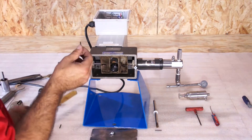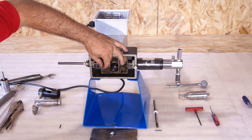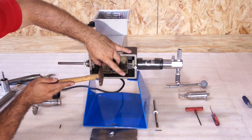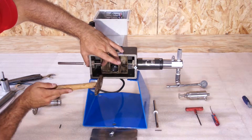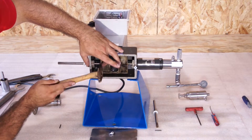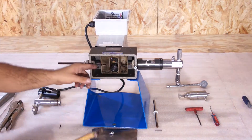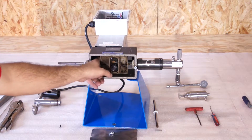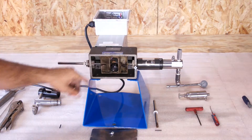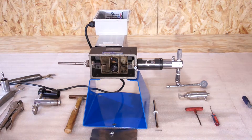Make sure the roll pin is still rounded. Then take your hammer. In position number three, which will be closest to the block, you get 100% of your injection or stroke length. Gently tap the roll pin in. Please note: do not tap the roll pin flush with the block. When you've completed this, you'll have about an eighth inch sticking out the other side of the reciprocating block — you want no more than that. If there's any more, it can shear off inside the housing.